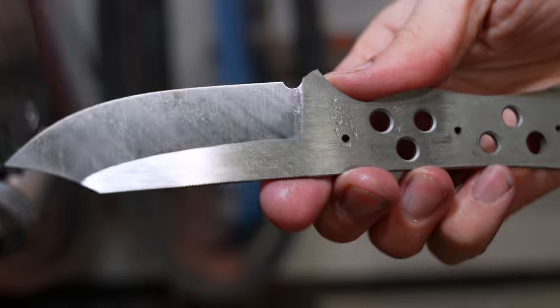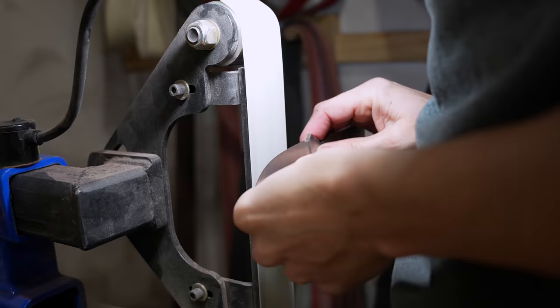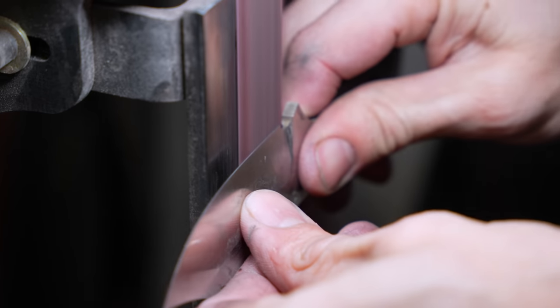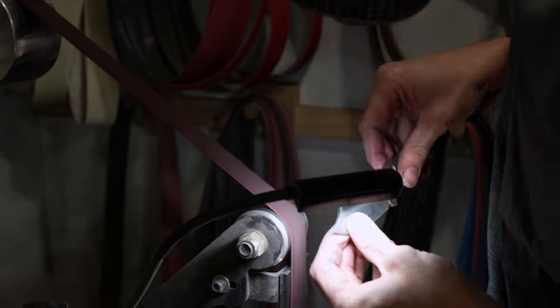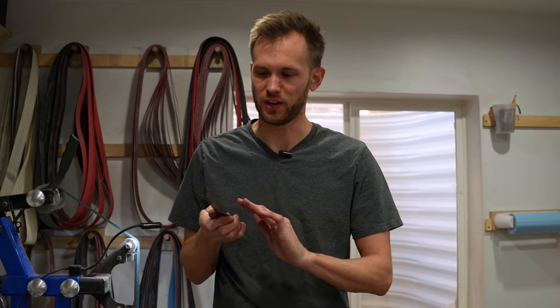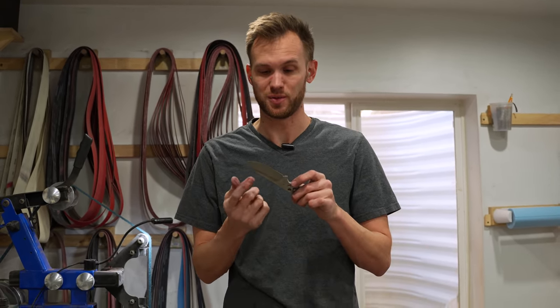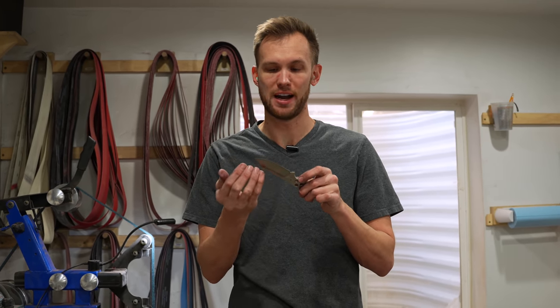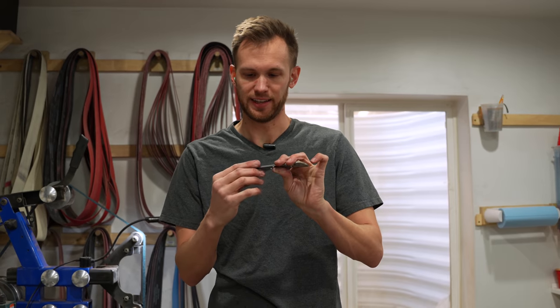I'm pretty happy with where I've got the grind. I like the shape — it's pretty symmetrical and nice and centered, with a very thin straight grind along the blade edge. Now I'm just going to do a little bit of surface conditioning. I'm very happy with the grind and the texture. I've added all of the bevel texture using the Scotch-Brite belts, but for these flat parts I'm going to take this over and do some hand sanding to get a nice crisp edge and a contrasting grind direction — I want the bevel lines going one way and the flat body of the knife lines going the other direction.